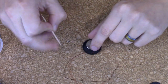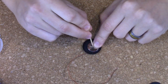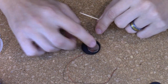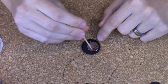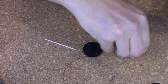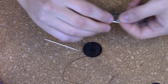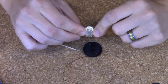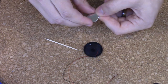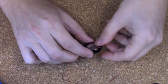With the magnets, we need to attach them to the base in some orderly fashion. The coin battery is fully magnetic. The coin battery is positive on the top and negative on the bottom, but it's also positive on the sides. So instead of connecting the positive end on the LEDs to the top, we can attach them to the side. Placing our magnets on the battery, we can kind of see where they'll sit. You want to space them out on the battery to make it stable while it sits underneath the base. If we place the battery with the magnets on the base, you'll see that the magnets, even though they're very tiny, stick the battery below the base, so the base won't sit flat. This means that we'll have to drill holes into the base and put the magnets in a bit.